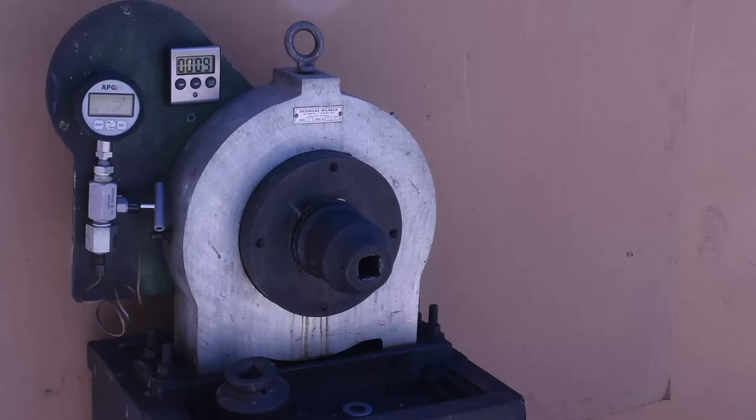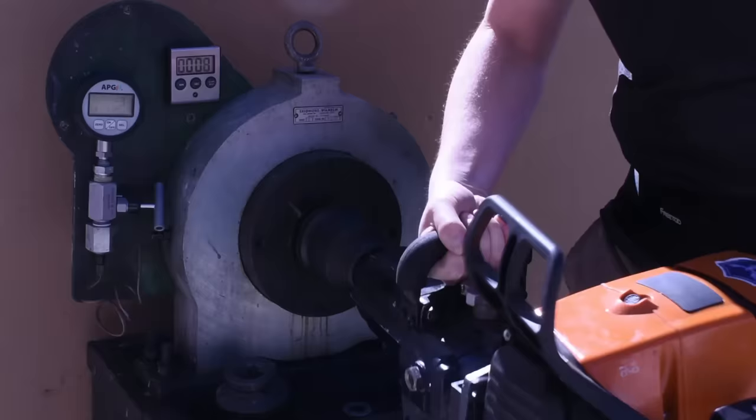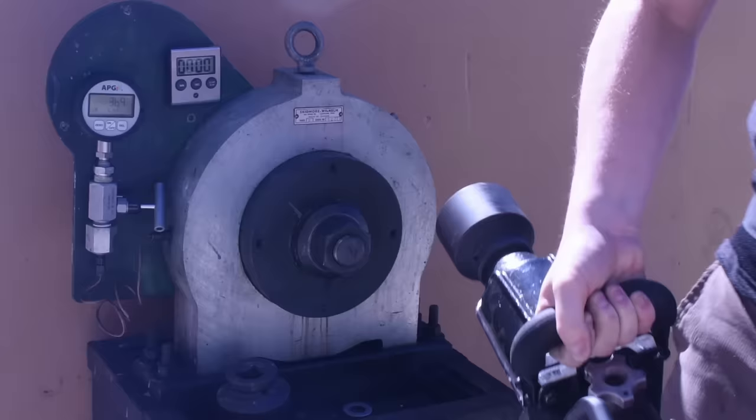And speaking of losing vital parts, onto the reason we couldn't show you this thing loosening anything above 1238. That is because after that, she wasn't fit to loosen even 638, much less 1238. Sounds super healthy still, but that's just the engine talking. There's no real beans coming out the anvil end. A 5-second test now registers like 370 foot-pounds. Lots more felt vibrations, some rattling going around in the gearbox, and well, it's not pretty.